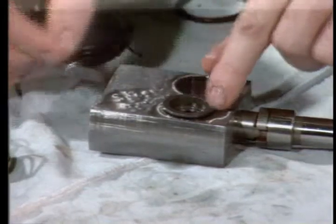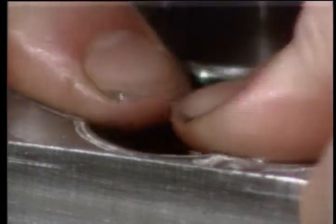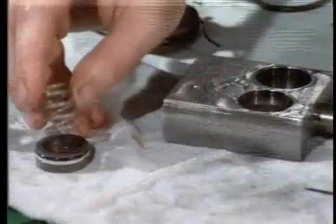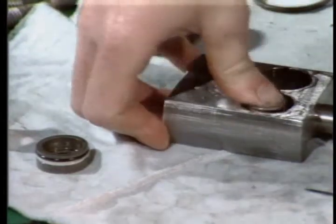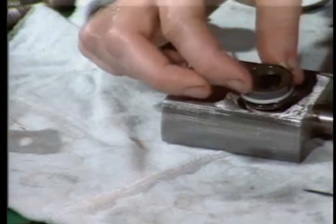At the seal rings and seal container, if you're using the old rings and plates, put the seal rings back into the bore in exactly the same positions they were before. It doesn't matter which side you place them in from, but place them in one piece at a time. Notice, too, the sealing edges and backup rings are toward the outside.